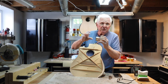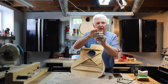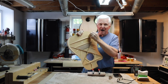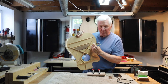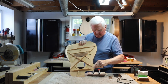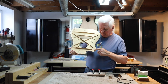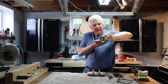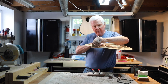This is simply a two-inch square block and what you'll do is set up your router for sixty thousandths of an inch, then you put this in a vise and just run your router over it and put some slots in here. What this does is it tells you when you get down to sixty — if it's too high it rocks back and forth like that, but when it gets down here it doesn't rock. So you know now that you have this at sixty thousandths of an inch, because you need something in here — you don't feather it right out to zero. You really want to have them at the proper depth. Up in this area of the guitar it gets a little tricky because this piece here is honestly too wide, so I nipped off the edges so that it would fit and I can still tell whether or not I'm at sixty thousandths.